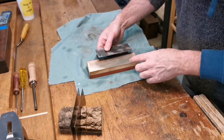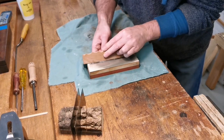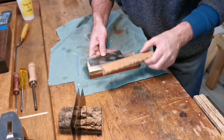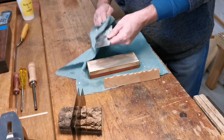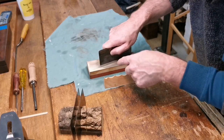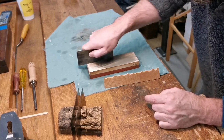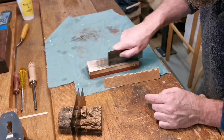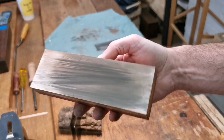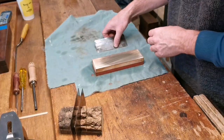Now, if you want to use a piece of wood across the back of here, by all means grab a piece of wood. If that makes you feel better, if it means you're being more accurate, do it. Do whatever you feel and learn from it. So I've done that — just going to polish the back of it, the square edge. I don't feel the need to put a piece of wood here; it's not going to make that much difference. I'm happy I can keep it quite close to 90 degrees. Look at how I'm varying how I do it on the stone — try and keep it random so it flats off nicely and you don't end up with a big hollow.